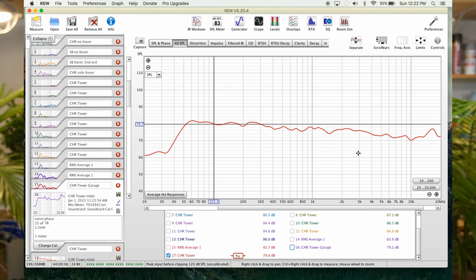And I gotta tell you something, those speakers sound amazing. They sound big for 5-inch drivers. It's powerful. They can handle a lot of power. I'm using my Pitch 3 amplifier, the Nova 300. I go really high on it. Low bass. Those are 5-inch drivers. I told you guys in the beginning, it's challenging to get that much low bass. So those speakers are more into the punchy bass. We get to 35 inside of the living room, from 100 hertz to 35 hertz. There's a drop of around 5 to 6 dB, which is normal.